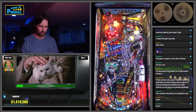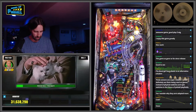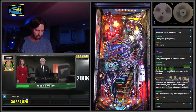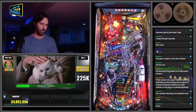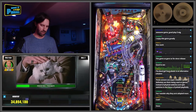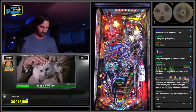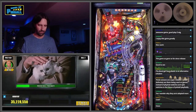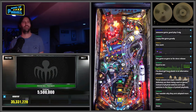Yeah, the opto switches have been pretty decent lately, but I've had a couple games where they've gone out. It's more the Spike 1 games. The Spike 1 games didn't have very good optos in them. Yeah, Spike 1, like Walking Dead, the one on the prison always went out. And it was like speaker cable wire for the optos. Kind of weird.